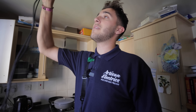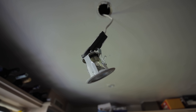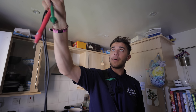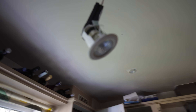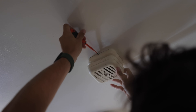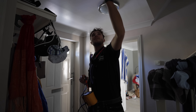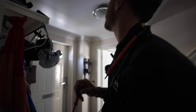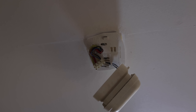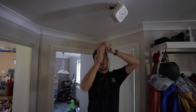One thing I will recommend is that these are replaced for fire rated downlighters, just because of the location — there's no fire hood or heat hood above here and it's a baking hot halogen lamp. What would you guys code that? No fire rated downlights in a kitchen with a bedroom above it — let me know in the comments. Definitely recommend a replacement though, I can tell you that much. And I think this smoke detector is definitely past its ten year battery date. Let's link that out and test both of those smokes.